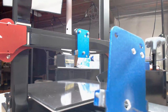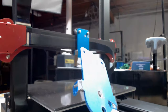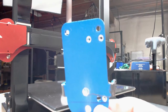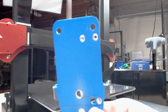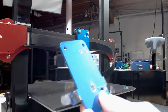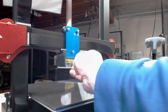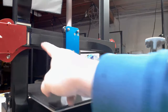What I noticed with aluminum is you can bend aluminum maybe once or twice. So I reinforced this with some JB weld and let that cure for 2 days, just to be sure. This is my spare piece. Gave it a couple of good tugs and I feel like it's gonna be okay. The smarter way of doing this would have been to get the CAD file for it or dimension it and CNC it out of steel, but time is of the essence, right? So anyway, what this does is now the belts are coming down, but this thing is able to do its full travel now, whereas before, because these were forward initially, it was pulling the belt way out and it would not make it here or here.